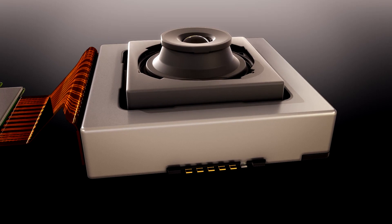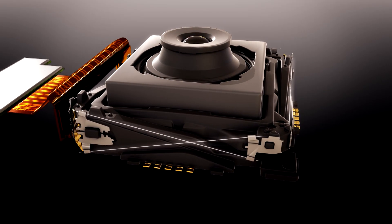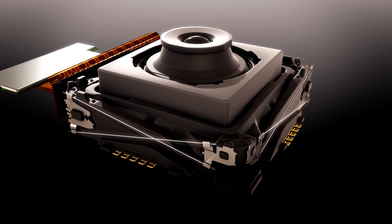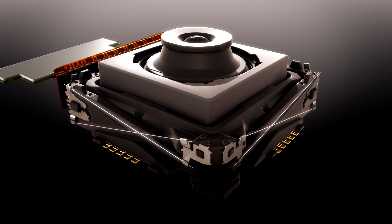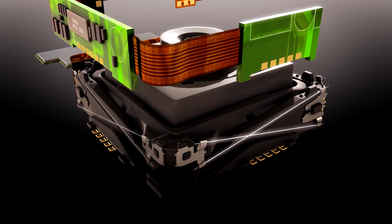CML's module tilt is an 8 SMA wire design based on an AF plus OIS product already in mass production. The length of the wires is controlled thermally using closed-loop control without magnets and hall sensors and free from electromagnetic radiation.